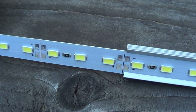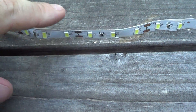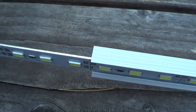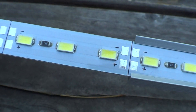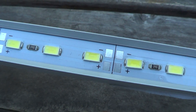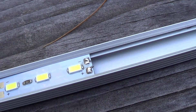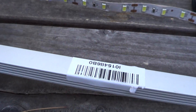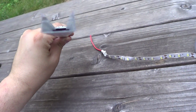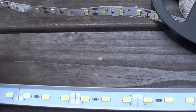However, it does require you to know how to solder to make it work. The next form factor I've used is a little more durable — you can see the reel stuff bends and flexes easily and is easy to short out. The more rugged option is these LED boards, where the LEDs are fixed directly to a board material. You can cut at any line segment, extend them as long as you want by soldering the end pieces together. These also work really well in aluminum channels specifically designed to accept these boards, making them more rigid, more durable, and helping with heat dissipation.